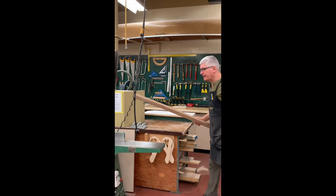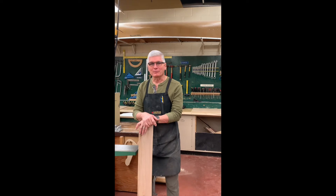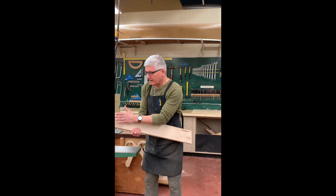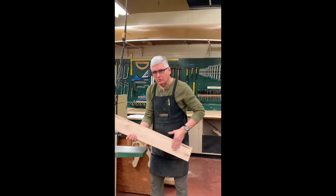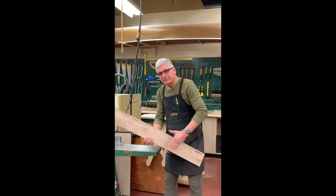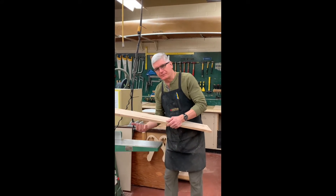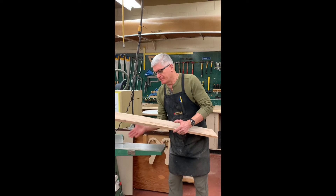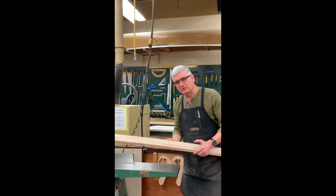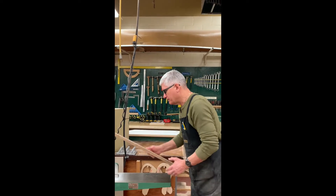I have a board here that has some problems. I should introduce myself — I work in Lockport, Manitoba as an industrial arts teacher. Here we have a board that has a warp — a bow like that. That is the concave surface, and that's the surface we want to face towards the blade. The convex surface is the other side. I'm going to repeat that quite often when talking about the jointer, because you have to know which surface faces the blades.